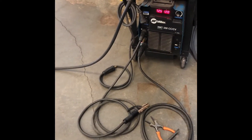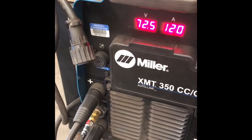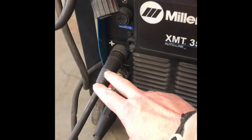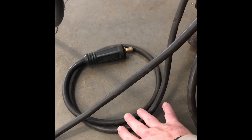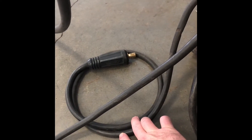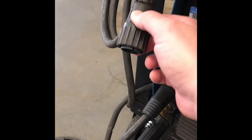So this is your normal setup in the class. These machines are being used by several people every day. Right now we had set up for stick welding. This is our electrode lead, this is our ground. Over here is our power source lead coming in from the 22A wire feeder. And up here is our pin connector, which is actually what tells the gas and everything else to come on too.